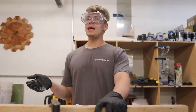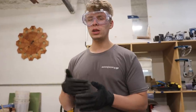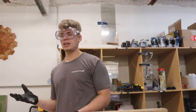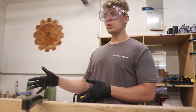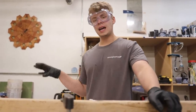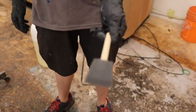In a previous video, we showed an edge where we sealed and it actually delaminated. The reason it delaminated is because we let the epoxy used to seal the edge fully cure before we did our second pour. All the epoxy on the edge was completely hard and we didn't even sand it after, so it was a shiny plastic that the epoxy was trying to bond to. For this one, we're going to coat the edge right now, then begin mixing our next batch. About two to three hours after doing this edge coating, we'll do the next pour, which means it'll still be tacky and we'll get a chemical bond instead of just a mechanical bond.